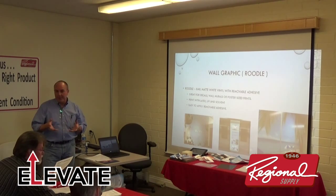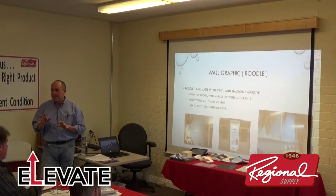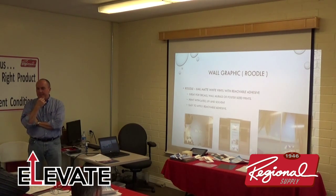If it's low VOC paints, just test, be sure. Low VOC paints have less volatile organic compound in them, and you have to meet those specifications. They've taken a lot of the stuff that we used to have in paints out of it. We do coatings too, and we've had a hell of a time with the graphics that we're putting over them. Low VOCs is bad, but when you get to zero VOCs, it's just terrible. We're having to let that paint sit on the walls for 30 to 60 days minimum, then come back and do almost a 70% alcohol wipe on those areas. We're using a product similar to this, the Avery 2611, which is a low tack. I think it's 6 mil, isn't it?